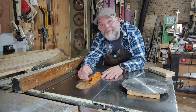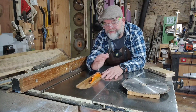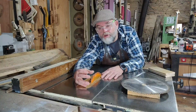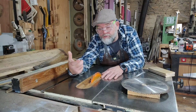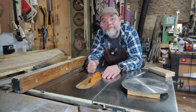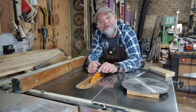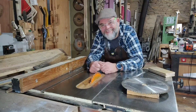And what I'm going to do is create a bayonet system. So the 2 bolt holes in this saw, they're for the original riving knife, which is attached to the flipping guard too, as well, because it's higher than the saw blade, absolutely ridiculous. If I make a bayonet system that can bolt to the original riving knife assembly, which I can then just slot in with a pin or peg or a single bolt or something simple, well then that's what I'm going to do. And I'll make my riving knives out of, guess what? Old saw blades. Like for instance, the body of the saw blade here would be ideal for a riving knife for this saw blade here. But I'm not cutting that one up. No, that'd be an old one.